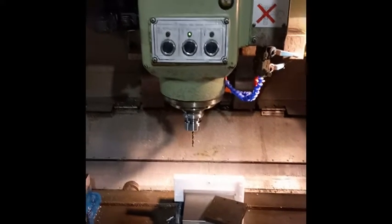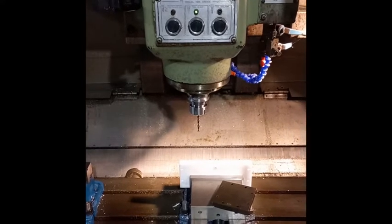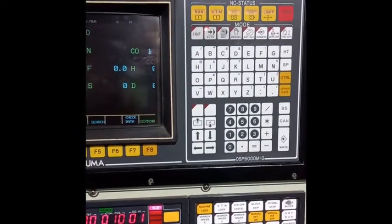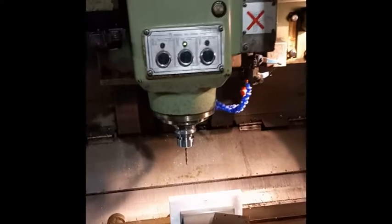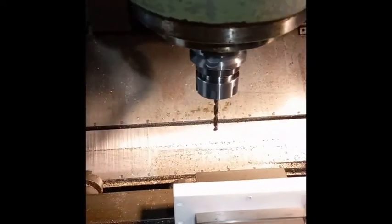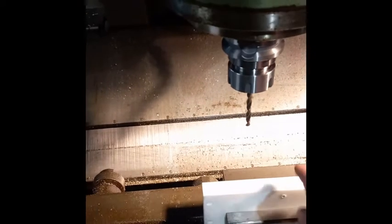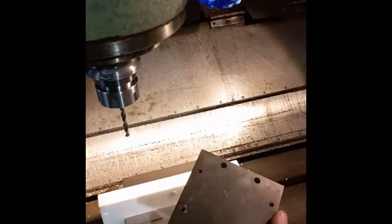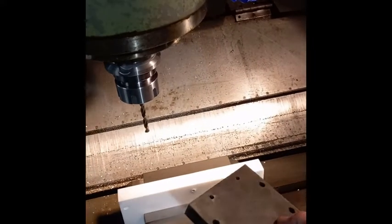I will try to be as quick as possible on workpiece and tool offsets on these older Okuma machines. The machine here is an MC4VA with an OSP 5000MG system. I have already prepared in manual mode. On this machine vise there is located this Teflon workpiece, and the new tool will be this drill bit. Here we can see the very crude slip gauge block. In this case, this steel workpiece is 100 by 100 millimeters in dimensions, so I can slip it under the tool.